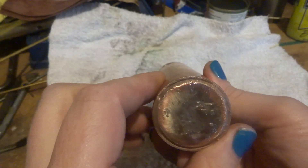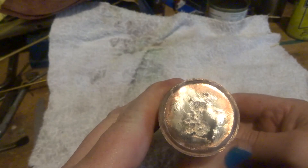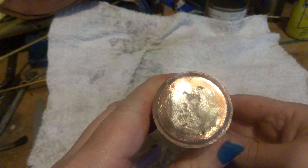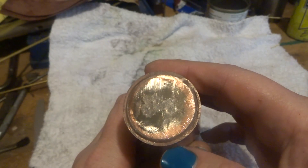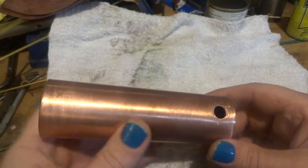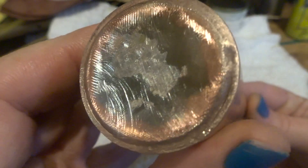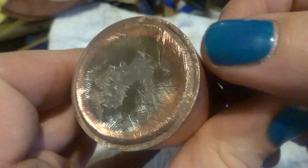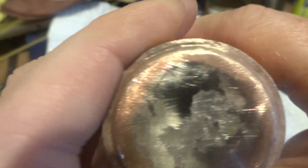Because this is brown tip solder which is only 15% silver, I haven't got a real good polished joint there, which is probably not a huge deal — but it's going to make it fairly hard to get it shiny. If you use 45% silver on copper you'll end up with a beautiful silver finish on the joint, and it looks good. So it's probably worth the effort to find some proper solder. But this is just plumber's solder and it's gone around really well for silver solder. It's got a little bit of a hollow point there but it's not actually going to leak — it's still a good joint, right round both ends.